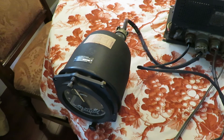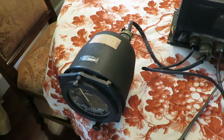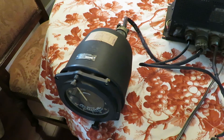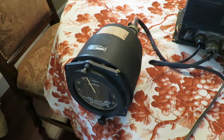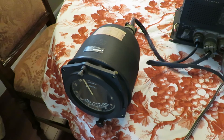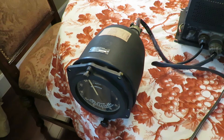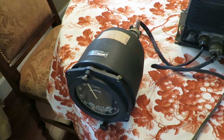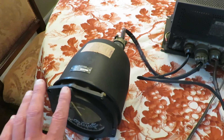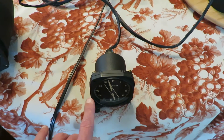The master indicator likewise has three major components: an autosyn, a magnetosyn, and a motor to drive the system. The autosyn takes amplified signals from the transmitter and operates the autosyn rotor and stator system, which is connected in a gear fashion to a small motor which drives the compass needle. The magnetosyn uses magnets rather than induced signals to create a magnetic field, and signals are transmitted from the magnetosyn in the master indicator to the magnetosyn in the repeater indicator.